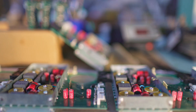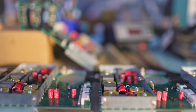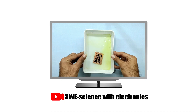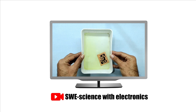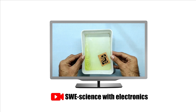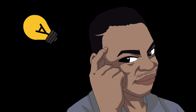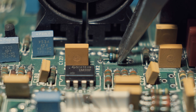This, in turn, fosters consistent interaction between the etchant and the PCB surface, resulting in a more uniform etching outcome. The physical implementation of this approach involves agitating the container holding the solution, either through manual means or automated systems. Now, I would like to share another idea. There are simple methods available for creating your own PCB etching machine.